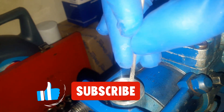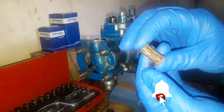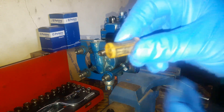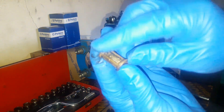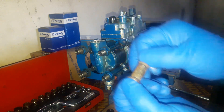Now we can access the filter and we're going to remove it. We need to clean this filter. When it gets clogged, insufficient fuel will cause the engine RPM to drop, and the control module will sense there is an issue with the engine speed — it will shut down the engine. And you will see it log an engine under speed warning.